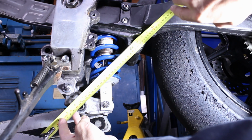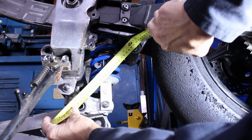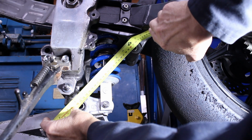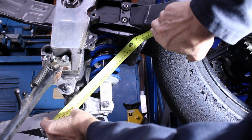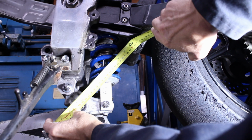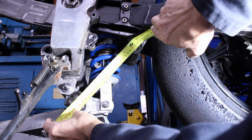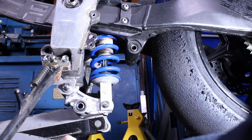Okay, let's measure. We're gonna consider the 10 centimeters as 0. And we have here from center to center 30.4 minus 10, so 20.4 centimeters, or 20 centimeters, 4 millimeters. But that is a rough estimate. So we're gonna make temporary dog bones, install them, get everything done, and probably one of the last things we're gonna do is machine the proper dog bones. Well, let's get to it.